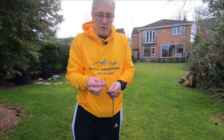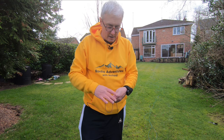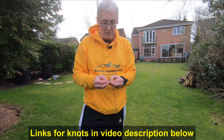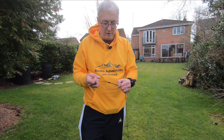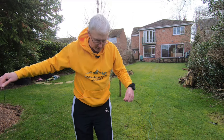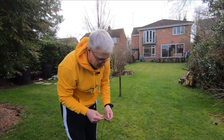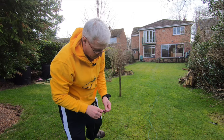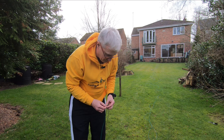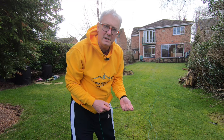At the ends of the cords for pegging the antenna out, I'm going to tie loops using a standard figure-of-eight knot — tie a reasonable size loop like that. I tend to use these longer cook's matches because they burn a bit longer, which makes it easier for this sort of job. Now I've got my two end guys — effectively extensions or insulators — and they just need tying onto the end of the antenna itself. I'm going to tie a bowline, but you could just use a couple of half hitches if bowlines aren't your thing. So that's pretty much it — the antenna is pretty much made now.